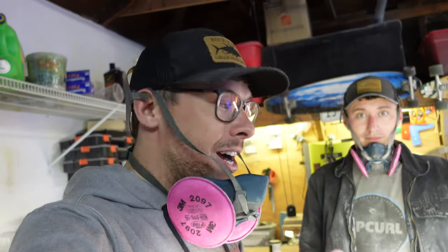We got there. One thing to know is that 45 grit, if I was doing that on a variable speed sander that just spins in one direction, would be way too rough. But random orbitals, since they're randomly oscillating, just don't cut nearly as aggressively. So essentially that 45 grit on random orbital is probably the equivalent of 80 or 120 on a variable speed sander just spinning straight. So, FYI.